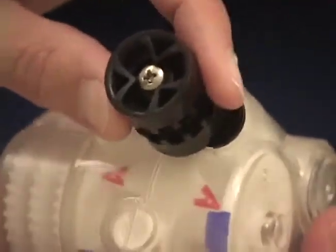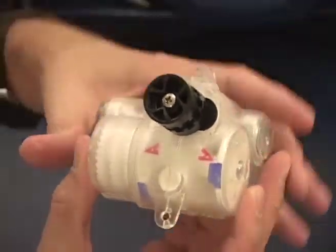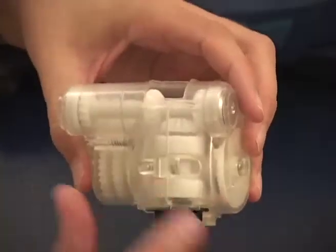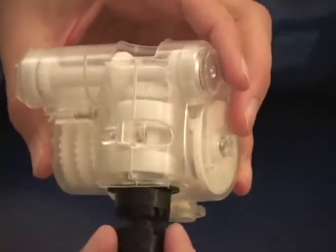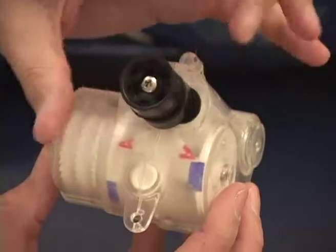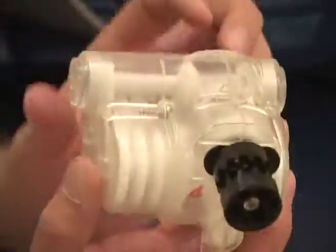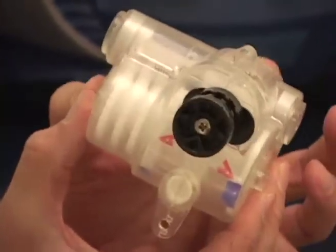When we're in that neutral position, when I turn the pulley, nothing happens. The pulley is free spinning. If you look up, you remember the gears are not interfacing. They're in between the forward and the reverse direction. So that doesn't mean anything is wrong with the gearbox. It's just that we're turning the output gear. We should be turning the input gear.